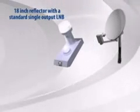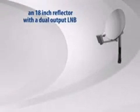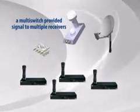When DirecTV first launched in 1994, there were two different ODUs. There was an 18-inch reflector with a standard single-output LNB that would provide service to one receiver, and an 18-inch reflector with a deluxe dual-output LNB that would operate two, and when connected to a multi-switch, could provide signal to multiple receivers. Most installers scratched their heads and wondered why DirecTV couldn't run everything down one cable like cable TV. Well, the technology just wasn't available.